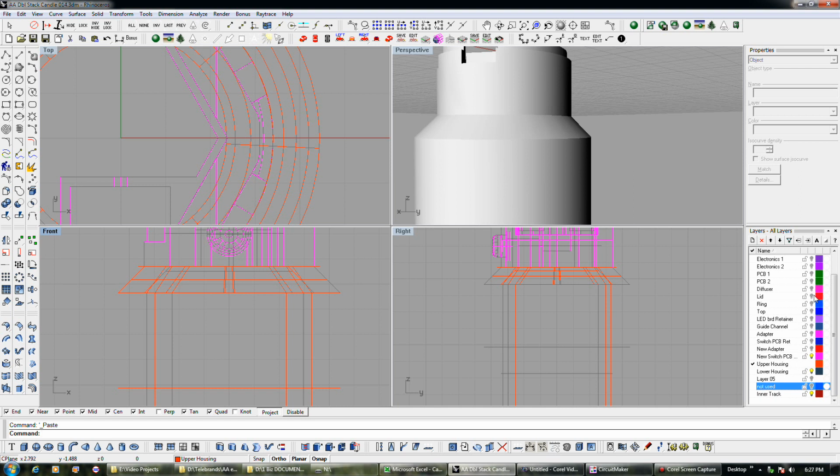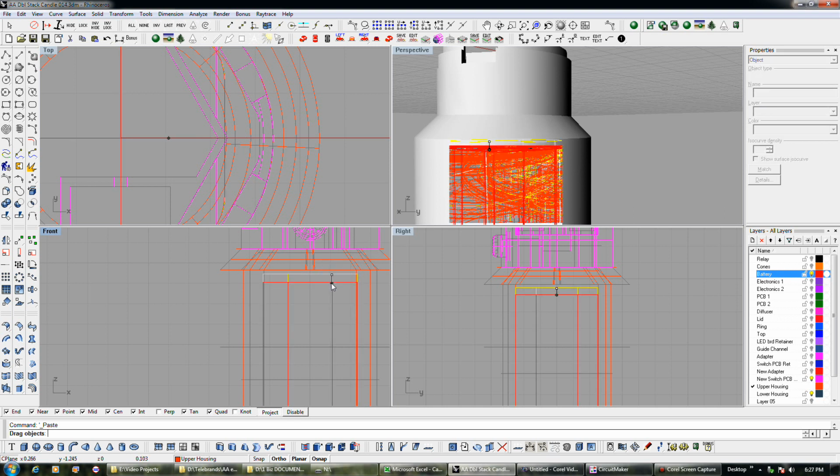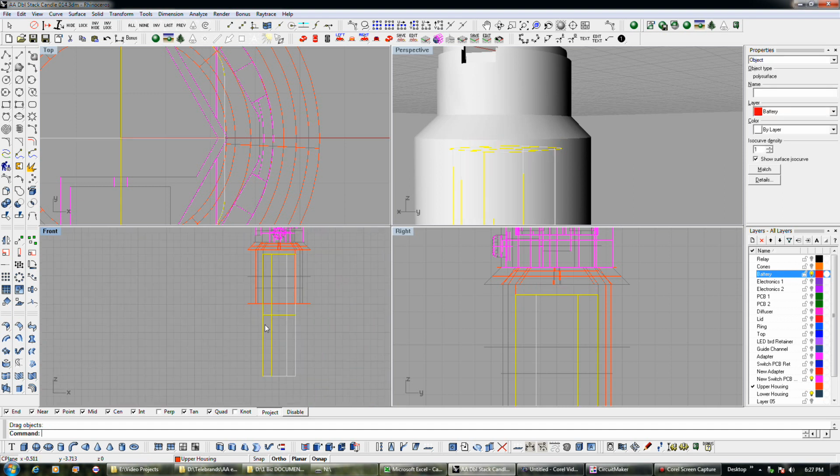Alright, at the moment, we need to look at the question of, is this enough room for lead wires from the battery container? Even though we've got a good quarter of an inch plus, we do have wires sticking up the top of the battery holder. And we do have a channel for them to go through up in here, but it's a little constricted. So I'm kind of thinking about moving the battery just arbitrarily down nearly an eighth of an inch more or so, just to give us a little extra play.